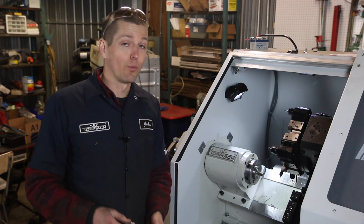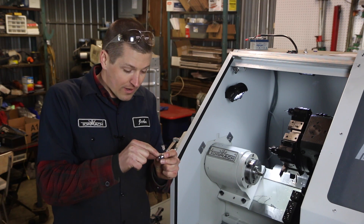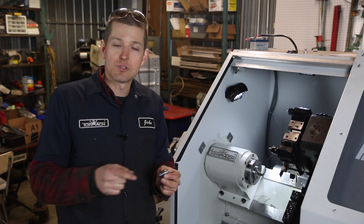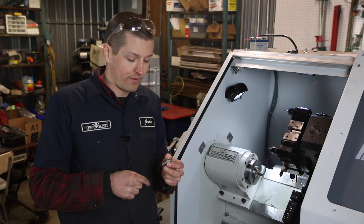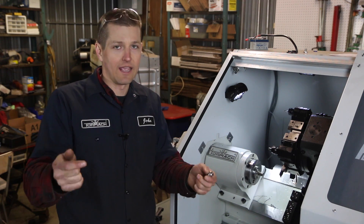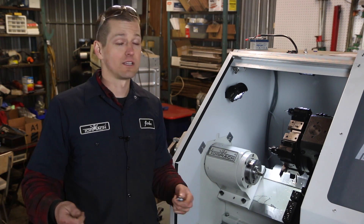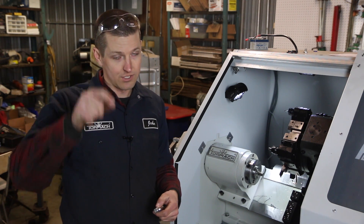The gang should be great for different drills and taps — they'll probably be hot-swappable. So much more to come. I'm so happy with this machine. I'm also being critical of myself — the threads, I said they're beautiful, but they do have slight tears on them. It could just be the inserts getting tired or wrong speeds and feeds — we'll figure it out. And I want to get the nub on the backside down a little bit less. As always, I appreciate your viewership, the thumbs up, the comments, the likes, and the shares. Take care, see you soon.